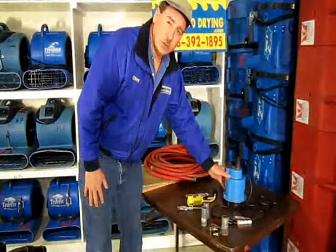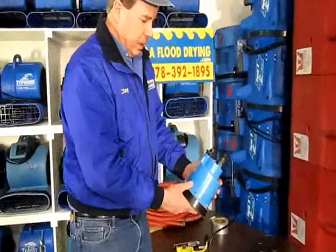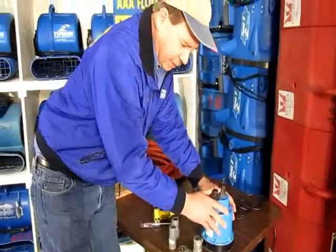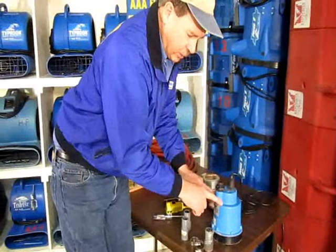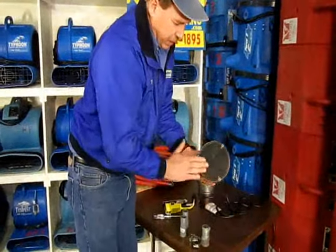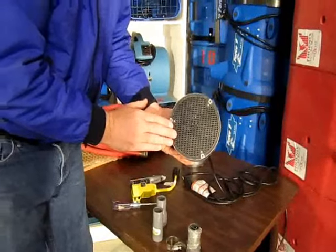We install one, two, or as many of these pumps as we need, but most commonly it's only one or two. There are a number of reasons why I like the Simmer pump. One reason is it's very wide on the bottom so it's very stable — it doesn't tip over easily, and that's a very good feature because when you put a hose on it the pumps tend to tip over. This pump also has a very wide and large water jacket that goes around the pump to keep it cool, so only a little bit of water keeps it cool and it does not overheat. There's also a full screen on the bottom of the pump so if a little bit of debris starts to plug up the bottom, this large screen will keep it pumping for quite a while.